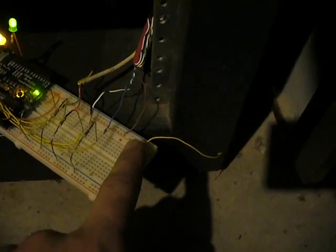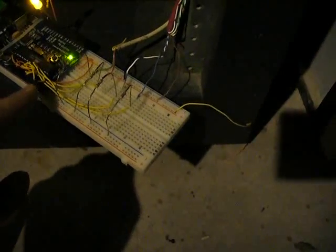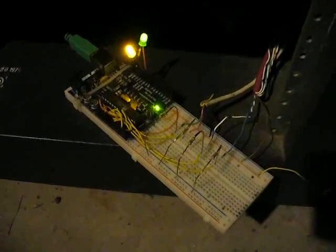Here's the Arduino end hooked up. I have 5 volts going to the photoresistors and then the signal wire back from them from the washer and dryer. Signal pins go to analog 4 and 5 for the washer and dryer respectively, with pull-down resistors on both. These are our status LEDs for the washer and dryer — both are actually running right now. The serial-to-USB cable goes into the back of one of my servers.